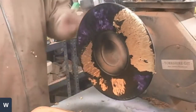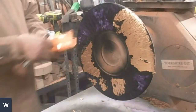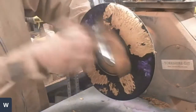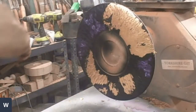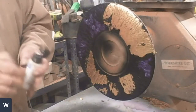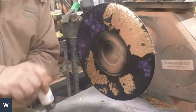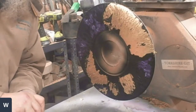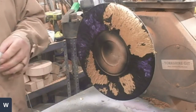Yeah, depending on what tree it is, obviously. To be honest, I'm hoping people aren't taking trees down unless they've been on a training course. But for the kind of cutting we do, there's every chance that whilst you're cutting a blank out, you just catch the concrete or whatever work surface you're on, and just bam, that's your chain dull. It's things like that where it's worth having a tool like that, because you've got to go back and reprofile it.